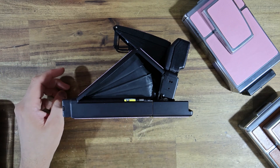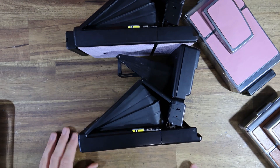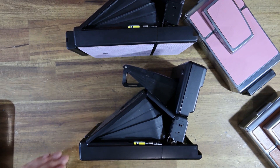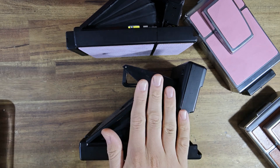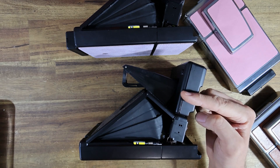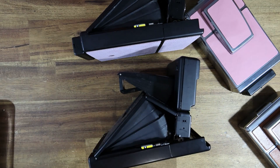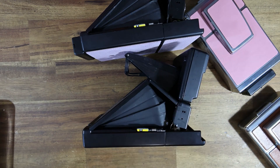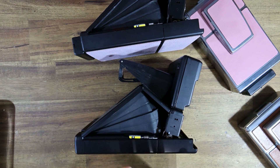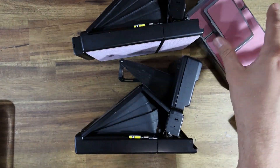My new and improved i-type solution works for any Polaroid SLR camera. I know people in the comments are going to ask if it's possible to use such an adapter with an SLR 680, being that it has the built-in flash. My answer is yeah, I think it's going to be possible — I certainly think this has enough juice to power an SLR 680 — but that flash draws a hell of a lot of amps. I don't really trust it being healthy for that tiny little buck converter over a long period of time. If you're a heavy user of flash, that huge power draw is going to be a little bit problematic, and I can't guarantee after a few years it'll last as long as the standard sonar and non-flash models.